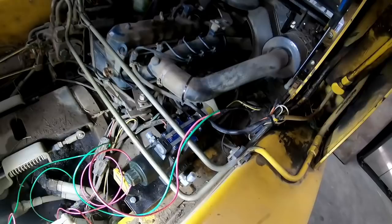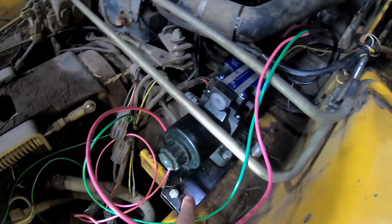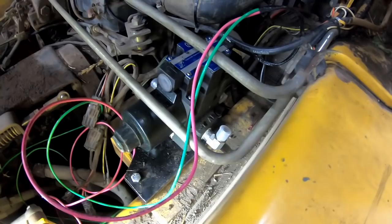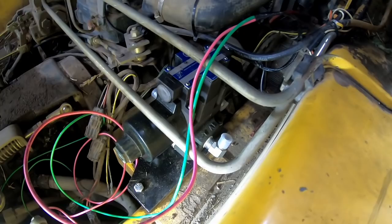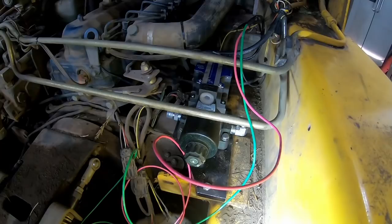So what I did was I had a piece of scrap metal from another project sitting around and made up this plate. I wanted it thick because I was going to be threading it. That worked out good because the back mounting bolt is underneath where I wanted to mount the valve, and so I couldn't have a bolt head there. There's already a mounting flange here for the optional valve that could have been on these if it was a 4625 SX or a DX.